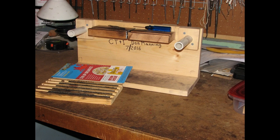The pieces that go together have to be demagnetized. Otherwise, you have trouble handling screws. They stick to everything because they're so small. They're 0-80.